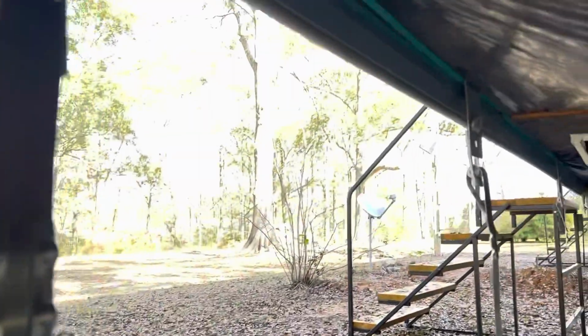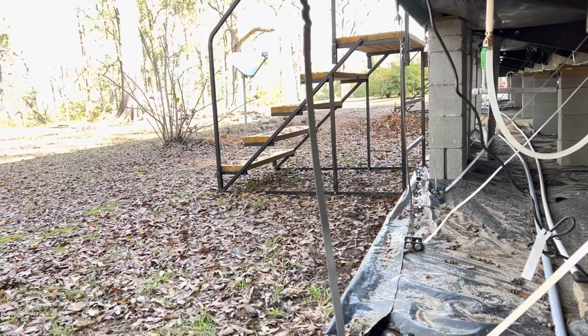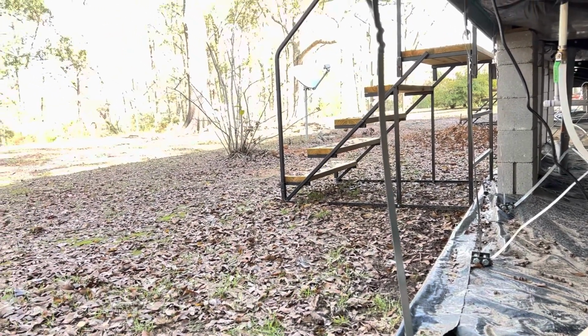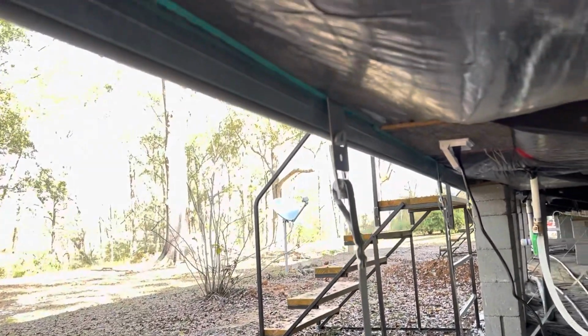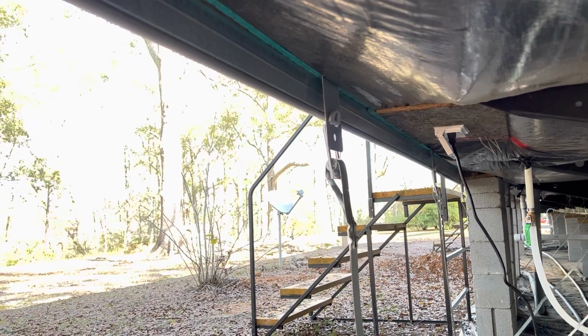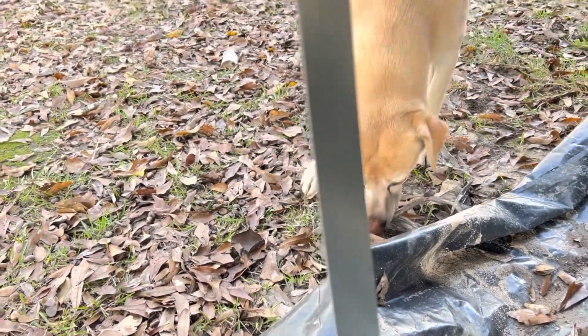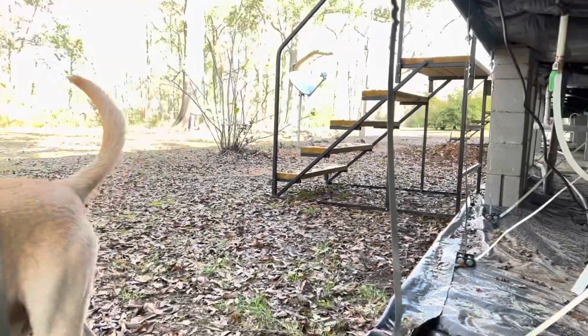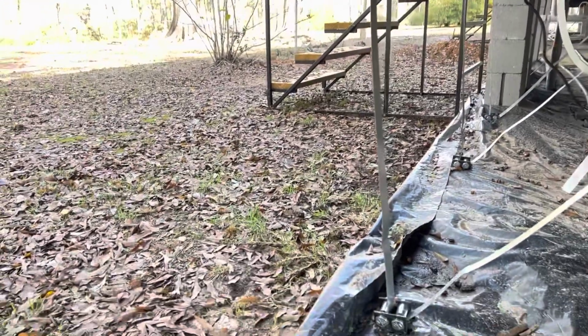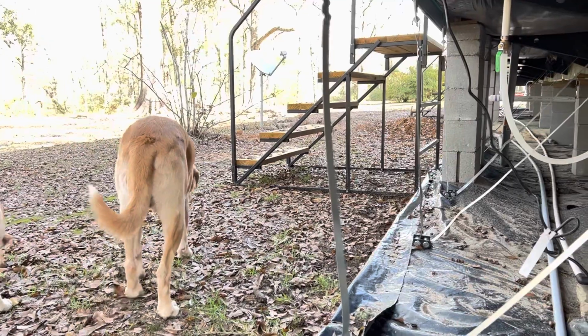So, if that's the case, I don't have a wood frame. And what they're telling me is I need to put a wood frame, because there's not going to be one. It's just going to be this track system that's going to hook my skirting on. So there's not going to be any bracing behind my skirting. It's just going to be basically hanging from the top down to the ground. Now, it'll be securely fitted into the bottom of the track that runs along the ground, but it's basically just hanging there from top to bottom. So no wood frames.